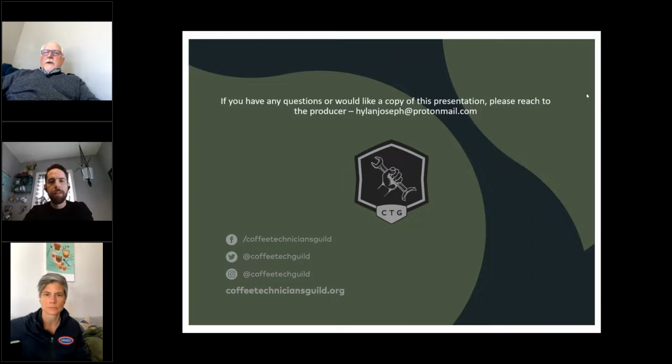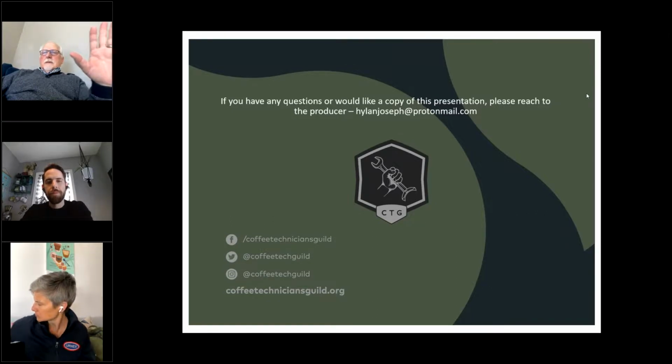It'll give you an indication of where to test. It won't necessarily give you an indication of what to test. So for example, it won't tell you what the resistance is going to be at the heating element or what it should be, because the schematics are relatively generic, and they might make 6 or 10 different versions of that particular machine depending on the market. So the resistance on the heating element, they wouldn't be able to put it down specifically.